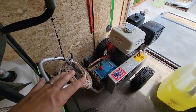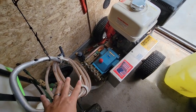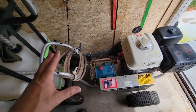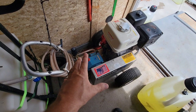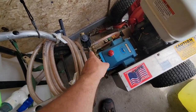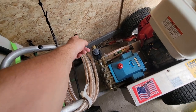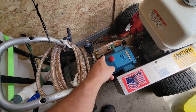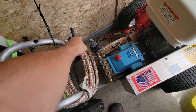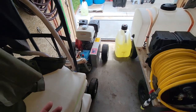I run a 4-gallon-per-minute machine. This machine is incredible — it's belt-driven, a Pressure Pro, 4 GPM at 4,000 PSI with a CAT pump. I love this pressure washer. Since I'm not running buffer tanks, this unit works fantastic. I did put a bypass/overflow on it so that when I'm off the gun, cold water runs through this T-fitting constantly, keeping cold water through the whole pump assembly. When I'm on the gun all water goes through; when I let off it just dribbles out. It's a perfect system for me.